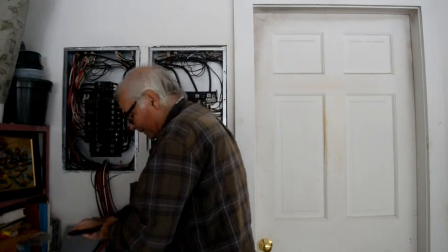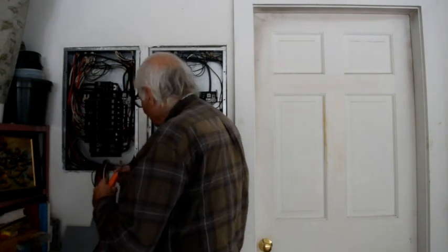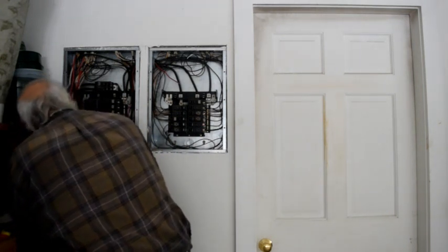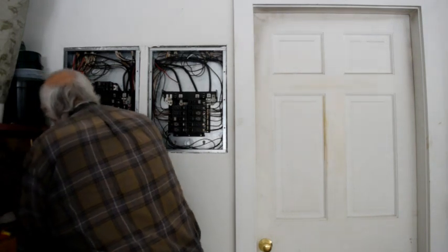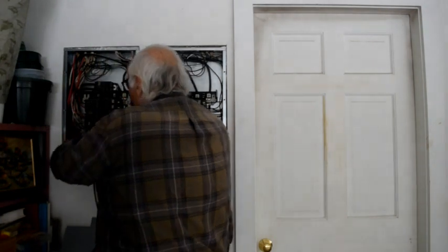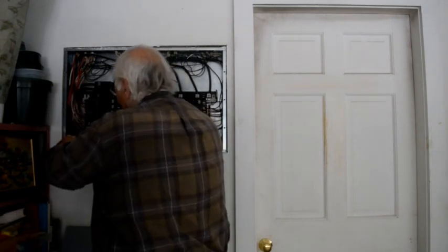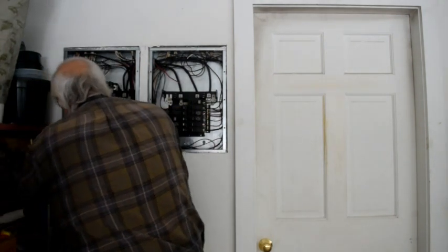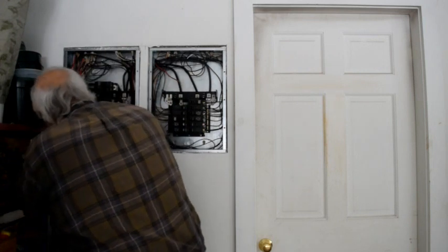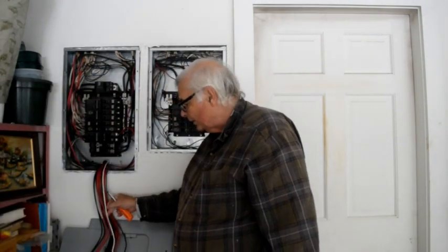This stripper isn't the world's best stripper. I'm going to open up a connection on the neutral/ground bus bar. I'll use this one — run the wire over and feed it in there. Before I start working on this, I'm going to turn the main breaker off, so the only power to the system is on these two points up here, which come in from the utility. That's in, so that's ready to go. I just have to repeat that with the neutral wire.